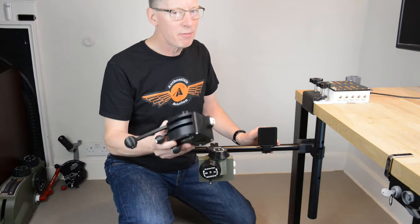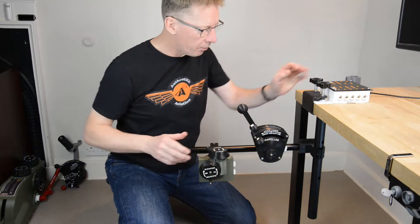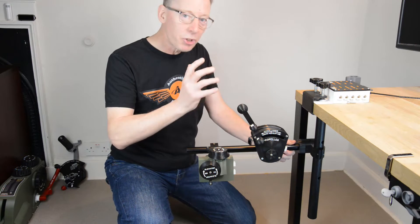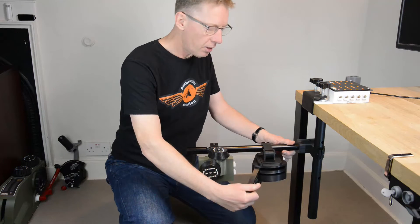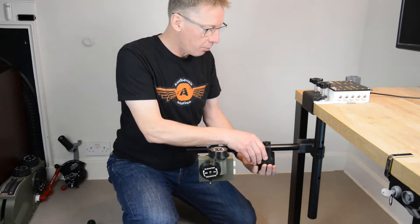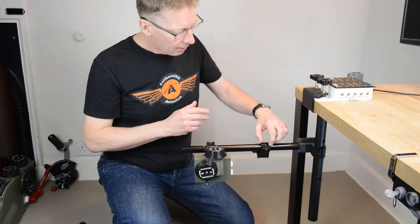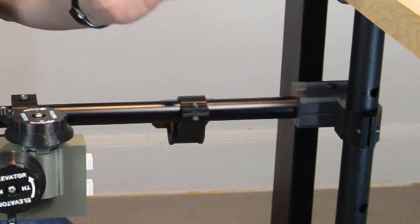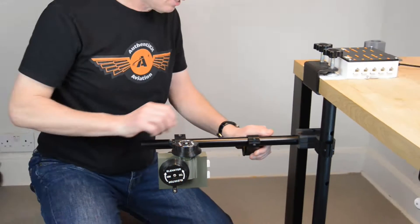However, I've never been truly happy with it. The clamp and mounting pole are great, but the aluminium tube has some shortcomings. However much you tighten up those arm grips, there's still a potential for them to rotate around, and the jaws are 3D printed. I recommend printing at 100% infill, but even then they're going to give and potentially crack. I was trying for a long time to come up with a solution that gives some steel reinforcement to that, but I never really did.